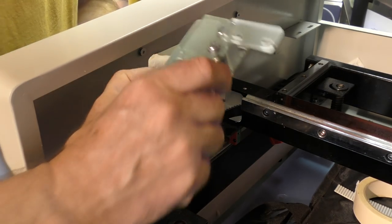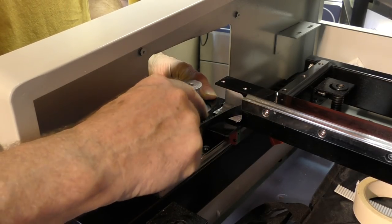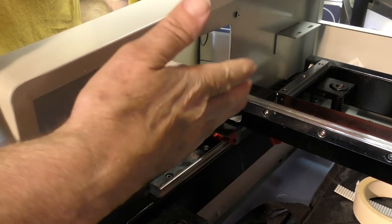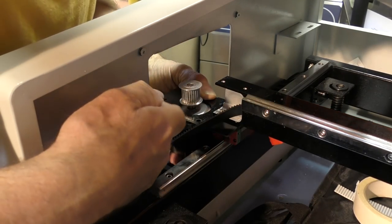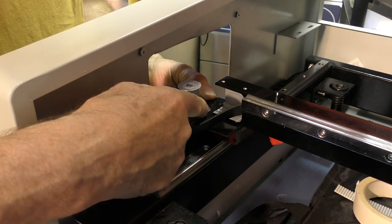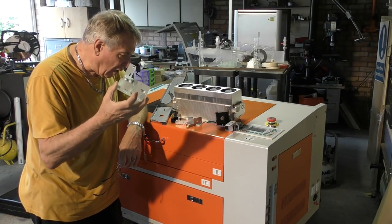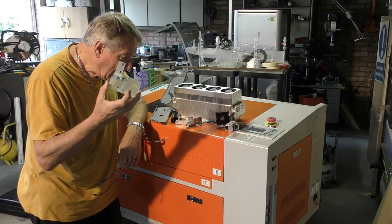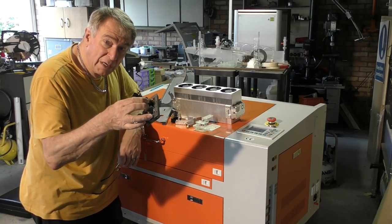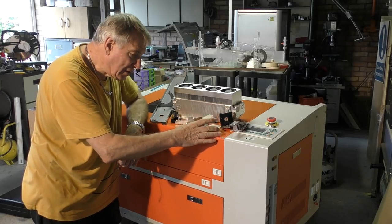So what I've got to do now, look, I've got about a 6mm difference there between where it was. So I've got to redesign a motor bracket as well to shift the stepper motor out. It won't affect the casing here because I'm not going to increase the size of the bracket. All I'm going to do is shift the motor further away from the gantry. I've got to make a Mark II version of my belt drive and mirror 2 holder, because Mark 1, which was suitable for my China Blue machine, is not suitable for this machine.